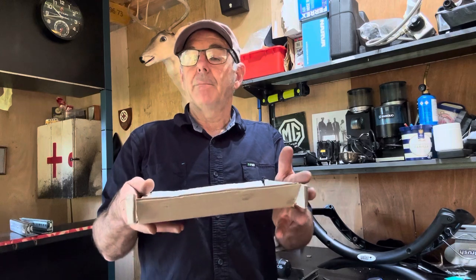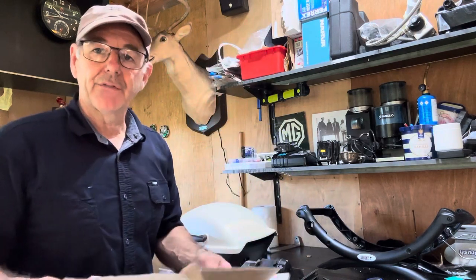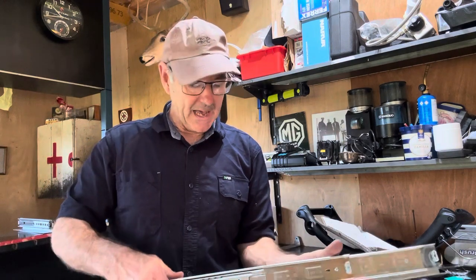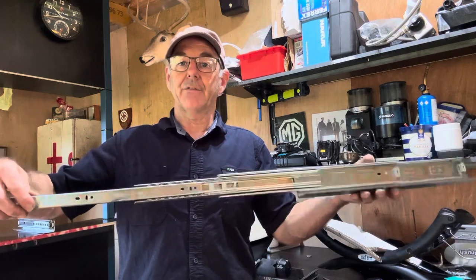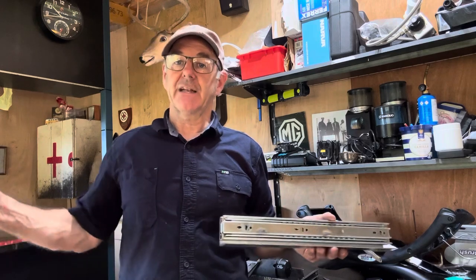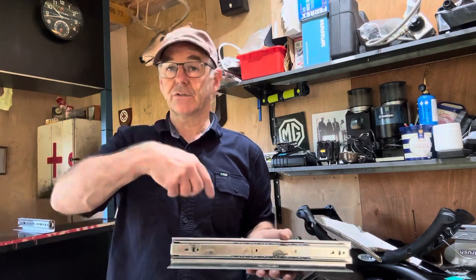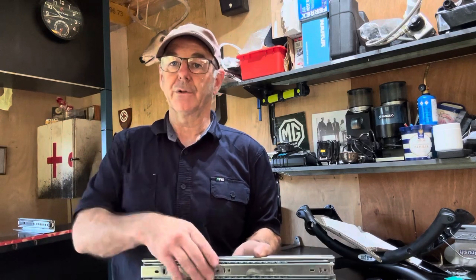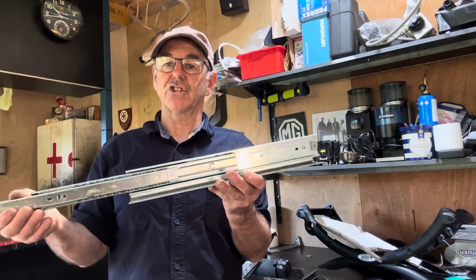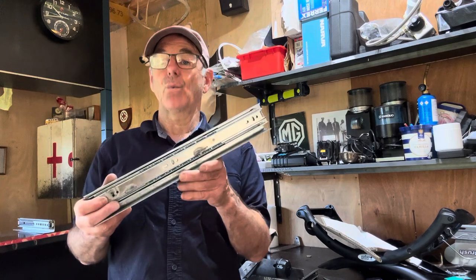That would give me an overall width of 560mm, which is the width of the 150% slides in my Elite Yield caravan. The 150% slides actually come out 150% of what they are closed — so 400mm closed, open to a metre. The barbecue sits in that 400mm, and when you pull it right out it gives you space for clearance around the back so you can lift the lid without it hitting the van, and about 20 or 30mm of air circulation clearance. If you haven't got a set of those, I made mine out of a cheap pair of Bunnings slides put together.